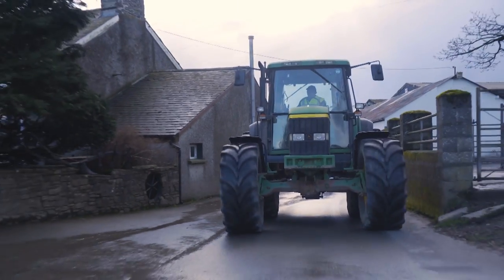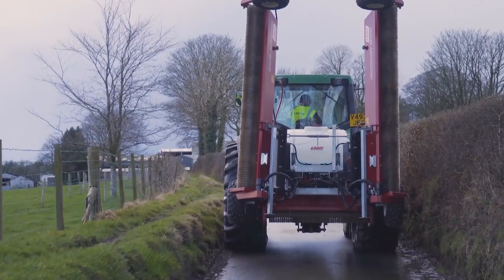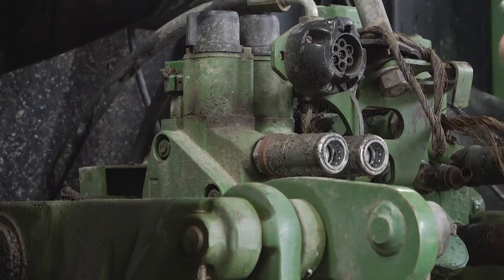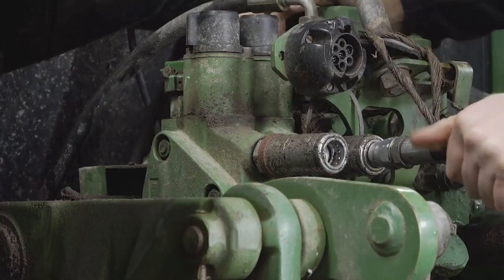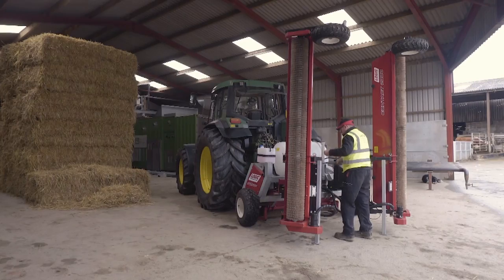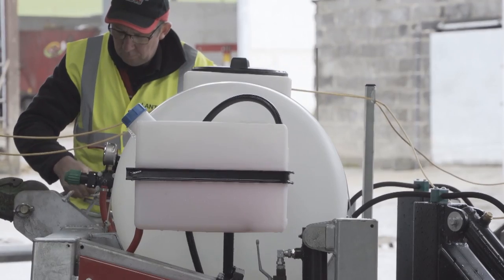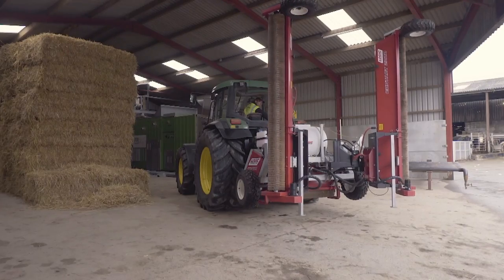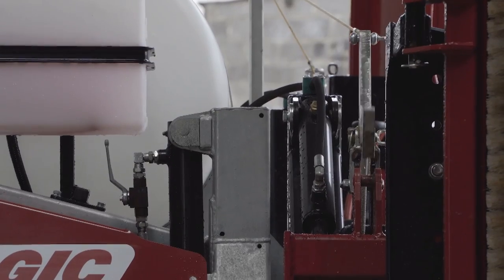It's particularly important to make sure your transport locking bar is engaged for use on roads and tracks. Connect your hydraulic hoses, connect the cab electrics, remove the transport bar and stow it. Activate the unfold and unlocking mechanisms for the transport locks.